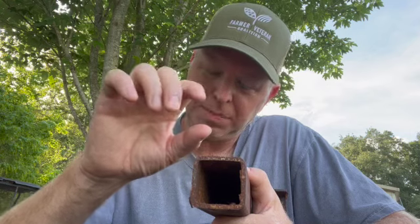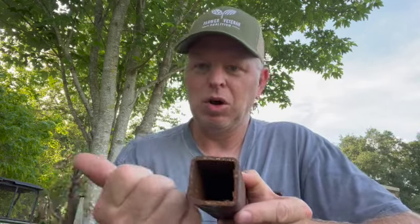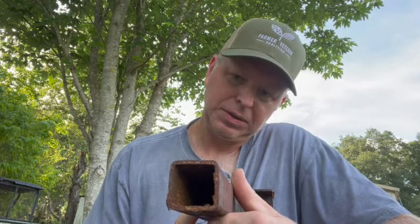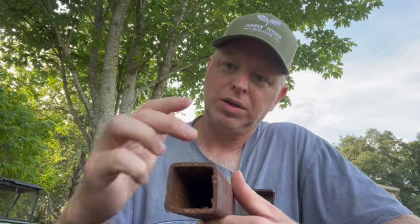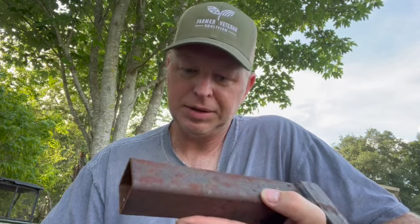And then I'll shape the tube that's on there now to flatten it a little bit so that this will fit over it, and that'll give me three sides wrapping around it with the open side facing in, and hopefully that'll give me enough on there that I can weld it into position on both ends. I don't know if that's really going to work, but it's the only thing I can think of without having to take it to somebody and pay a bunch of money for it. Anyway, this is the equipment I have, so we'll give it a shot, see how it goes.